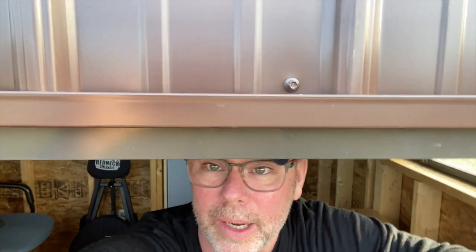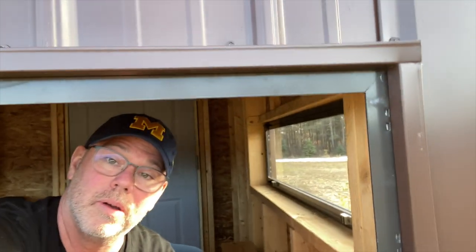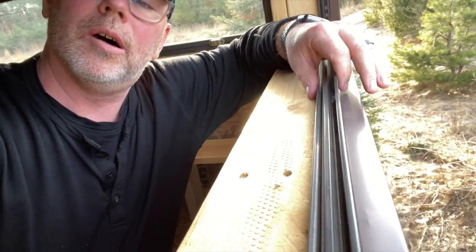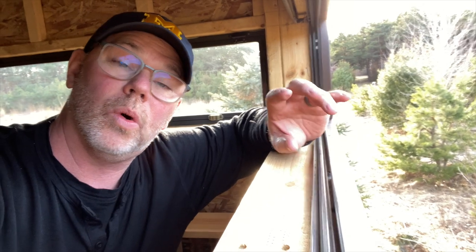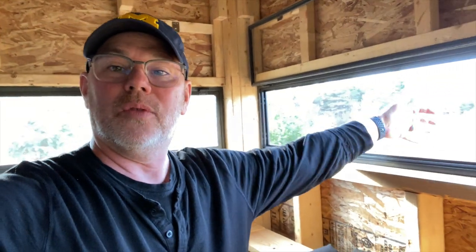I'll try to get a shot of the outside. We used steel barn siding, and this right here is the window. There's a lip up there and it's all framed — you put it in, a couple of screws, and then snap the window in. It really works well. You can see the different channels here that it has, so that if snow or water or anything gets in, there are little drain holes and it goes down and out — it doesn't come in and rot the wood. That's another reason I went with the ones that go from the outside in; water won't sit on the framing in any way.